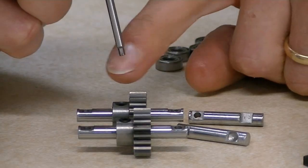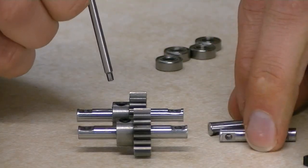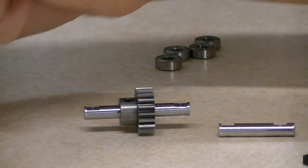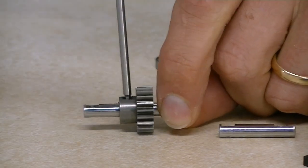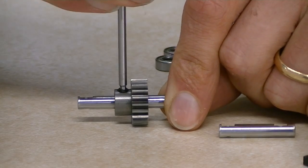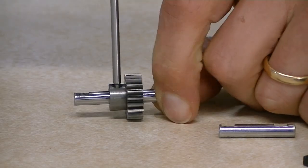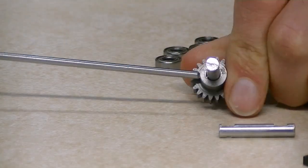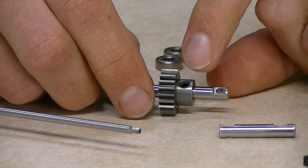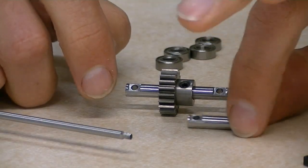The bottom of the hole actually fits the set screw, so when the set screw goes in it has a really solid seat. Not only does it fit into only one position — the set screw now actually sits in only one spot, so the gear doesn't slide around on the shaft anymore like it used to. Once it goes in, it can't slide around anymore. And then you give that some blue thread locker — our favorite is Permatex blue thread locker gel. You drop it in the hole, fill the set screw in, jam it, the blue stuff squirts out all over the place and it's fantastic.